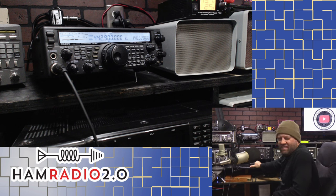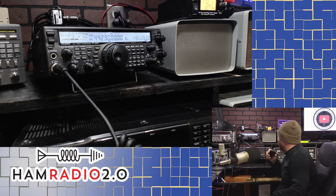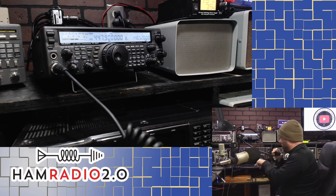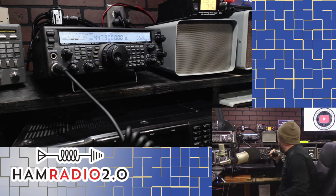Roger, Roger. You're sounding clear and crisp on my end — no bacon fry or anything. Is this on a handheld? No, this is my base station, my most recent update. I installed a diplexer — I've got a Yaesu FT847, which has four antenna ports in the back. One is for HF, one is for 6 meters — those two are not connected. Then I have a 2 meter and a 440 connector in the back. I have a Comet diplexer, a CF416, coming off the back and going into some M&P coax.